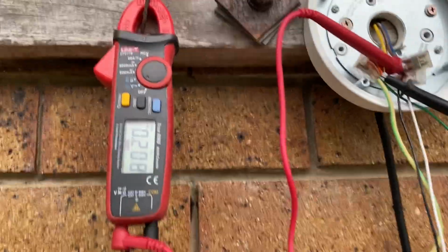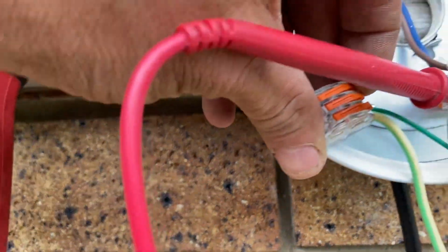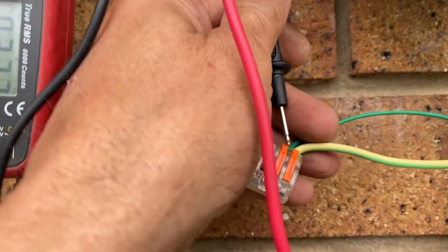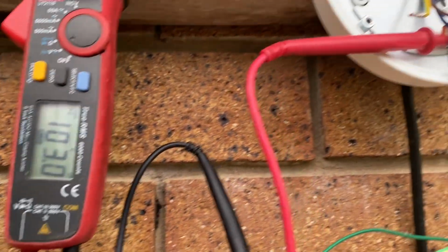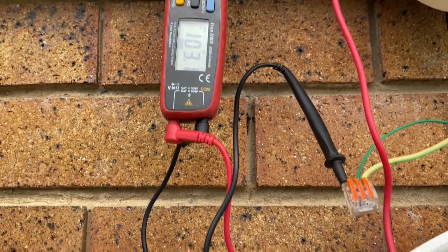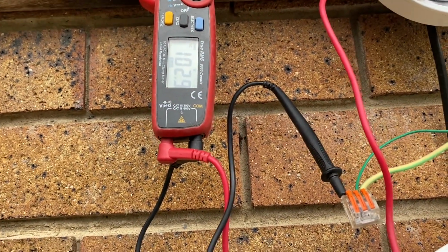Okay, good new location. Check out my voltage. We've got an earth hooked up to it this time, just on one of these little plug and play leads. Let's see what happens when I disconnect the earth, eh? Obviously don't go do this shit. Just know what you're doing. Now, before I was getting 110 volts. Look at this sucker. Look at that. So with no earth connected, you get that voltage. So I go touch this frame, now I'll get tingles on it. Yeah, crazy. This must be how the power supply is built in this sucker. Yeah, so make sure you connect that earth.